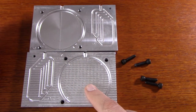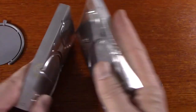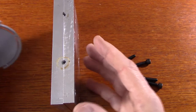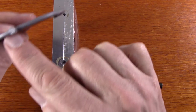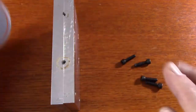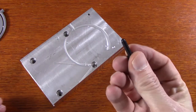This side is flat, which means I don't actually need perfect alignment between the two mold halves, so I don't have any alignment pins. If this is off a little bit, it just means that the runner itself will not be exactly circular — that's all it means. So what I do to be able to make a part this size is use screws.